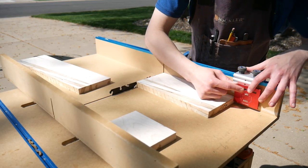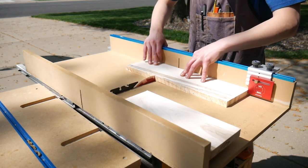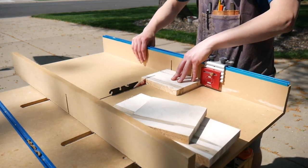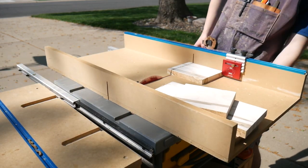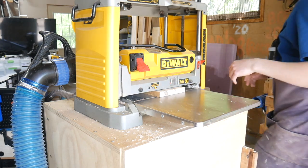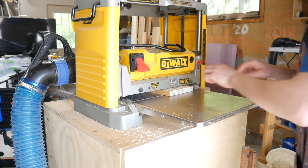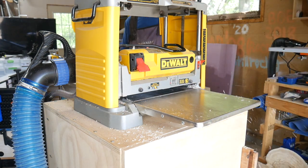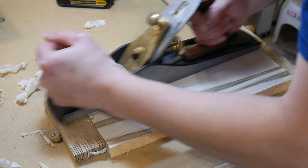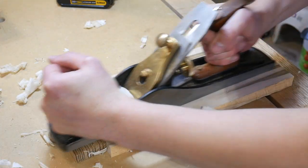After cutting out one of the sides and one of the end pieces, I then use the cutoff as a stop block to perfectly set up for the corresponding opposite side and face. I do this because in order to do the continuous grain you have to cut side and side, end to end, every other — so you can't just set up a stop block and cut both at once. I then bring them into thickness and clean up the face at the planer. This is an essential part of good miters: you need the thickness of all the pieces to be exactly the same. That left a little snipe, so I do one or two passes on each piece with the hand plane to get rid of it.